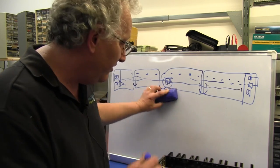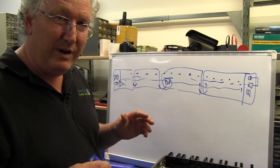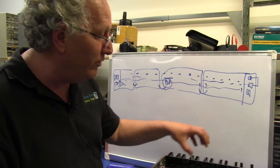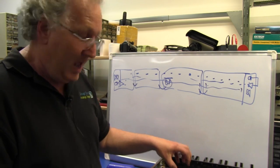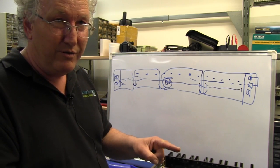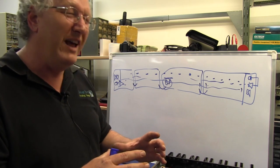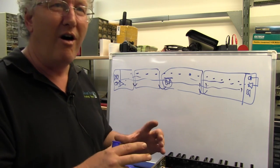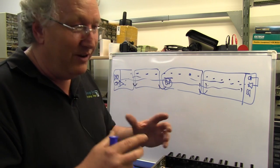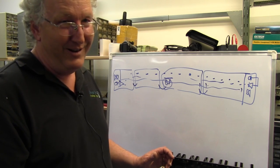Incidentally, in the earliest amplifiers, we were not made aware of this particular problem, as a result of which, you'll see in a minute, there's a couple of toroidal transformers under here. The larger of the transformers would get 120 volts straight up it. It was sufficiently large that it would actually take quite some time to die, maybe tens of seconds. During that period of tens of seconds before it ruptured, there would be a lot of smoke emitted.